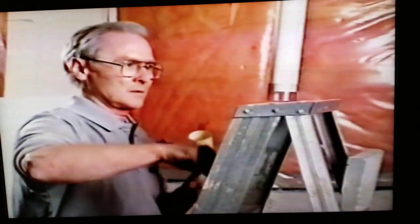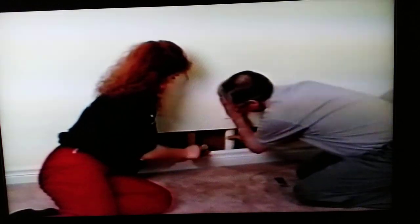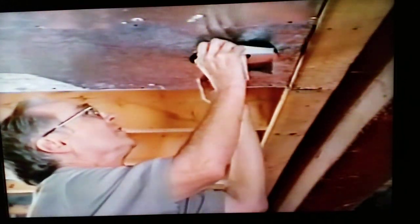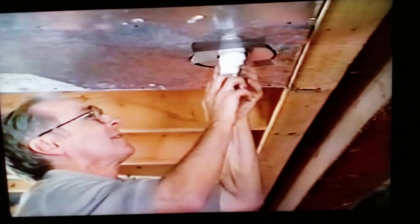For an inlet valve connected through a cold air return, the procedure is just as simple. If you're pushing pipe up to another floor, you'll need a helper. Once you've trial fitted the pipe, glue and connect each section of pipe together and push it up in the cold air duct. Continue this until the helper sees and takes hold of the top end of the pipe. Now go upstairs, glue and connect the pipe to the white 90-degree elbow. Now connect the pipes through the cold air ducts at the opening you cut earlier, close it using duct tape on the patch. Then connect the fittings and the pipe, and connect this line to the main trunk line.